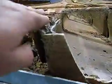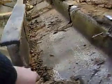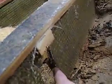All right, and then they took a very heavy woven cloth, and they laid it from the outside. They came up and over that stringer. They came down here. They came up and over the keel, and then they took that same cloth, they extended it over here, went up and over the stringers, and then once they came on out to the edge of the boat. And once they got done with all that, all the way up through here, you can see how the cloth is one continuous piece of cloth here. You can see how they did that, and then it laid up and over, and they left these open here. They must have been expecting water to infiltrate sooner or later into that. And you can see there's the original layer of boat, and here's this layer of cloth that they added to fasten this whole assembly in place.